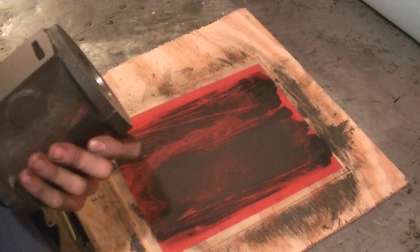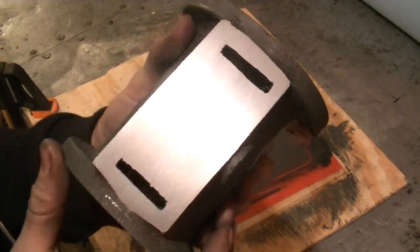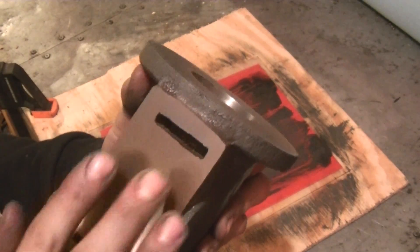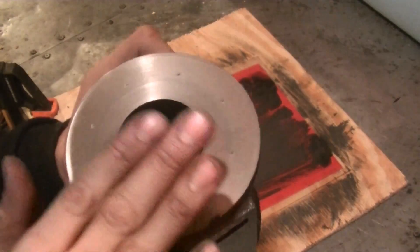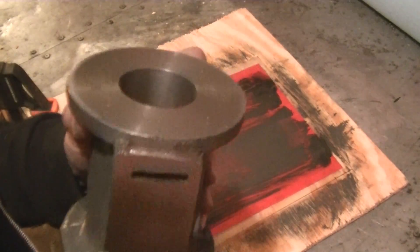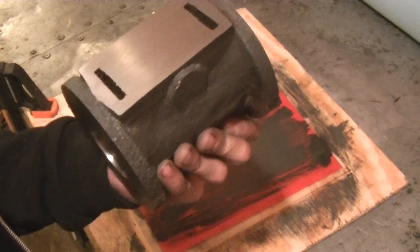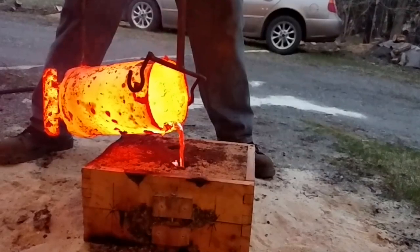I just finished going up to 400 grit and we got a really, really nice surface finish. Really happy with that. Next we have to lap the top and the bottom, although I might drill the holes first and do all the holes at once. After that, that's it — just the holes and the lapping and we'll be good to go. We'll see you next time.